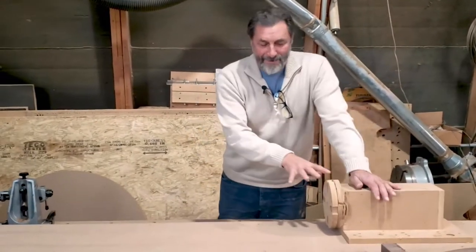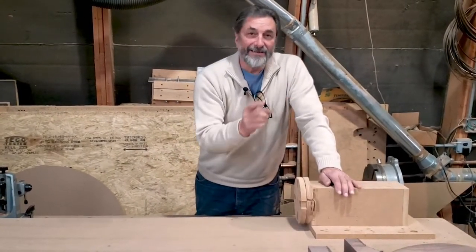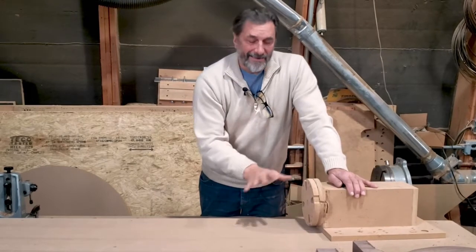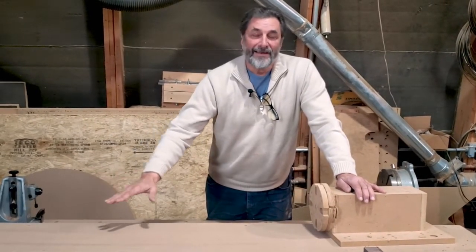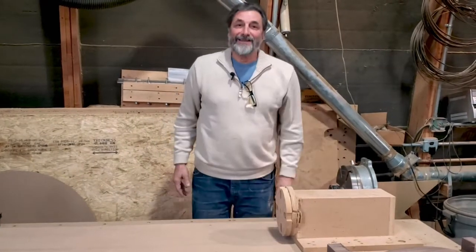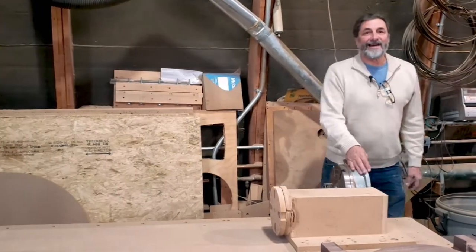After I mill the top surface — and it puts the twist in the top — I would then know from the drawing what rotation I need to get the side, or rotate 180 to get the bottom. So this was like a manual fourth axis: it worked, it wasn't convenient, but it worked. Then I started thinking it was time to put a proper fourth axis on.